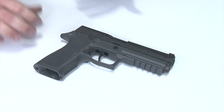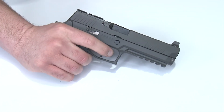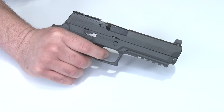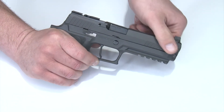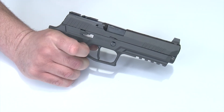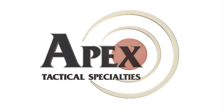With everything fully assembled I'm going to do a functions check. I'll pull the slide back to make sure we're unloaded, then pull the trigger — hear the striker fall. Hold the trigger down, cycle the slide and release slowly, get a reset, re-engage, it drops again. I'll release the trigger entirely and pull the slide back to check — this is normal function. As you can see, the installation of the trigger and bar is pretty straightforward. The most difficult part is getting that spring back on, but our tricks give you a pretty easy way to do it. If you have any questions with the installation, always contact Apex customer service — we'll be happy to help. See you next time.